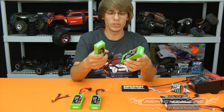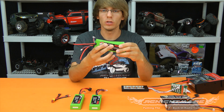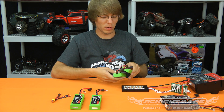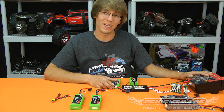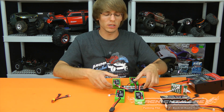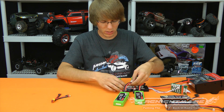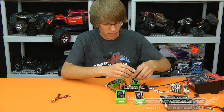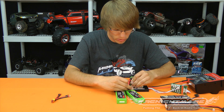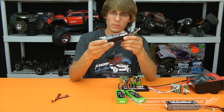In terms of actually setting up your charger: if I was charging one 5 amp hour 2-cell pack, I'd set my charger to 2-cell at 5 amps. But if you're charging two at a time, you have to set your charger as if you're doing a bigger pack. Two packs gives you 10 amp hours — so set it to 10 amps at 2-cell. Three packs gives you 15 amp hours. Four packs gives you 20 amp hours. You can plug up to six at a time into this board and save yourself a ton of time.